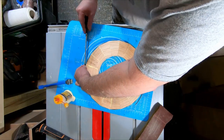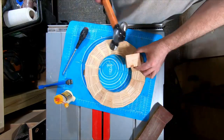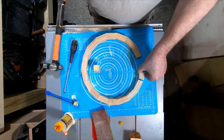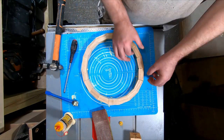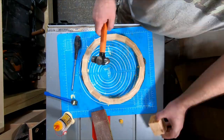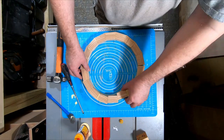The four rings went together very easily without the need to make any adjustments to the angles to get a good fit. This is mainly down to using a purpose-made jig on the table saw. It was easy to make — just a piece of 12mm ply with a tight-fitting oak rail glued and screwed to the underside that runs in the table saw track, and a fence glued and screwed to the top at a 10 degree angle.